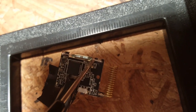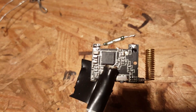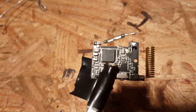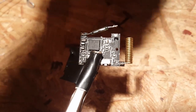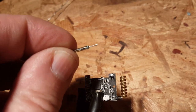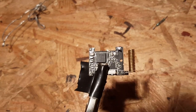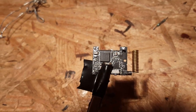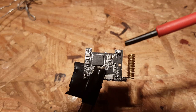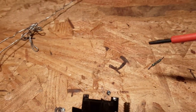Stick a tiny screwdriver in while heating the solder and it pops right out. Hold the other side, heat up the other solder point, and pull the sensor out. The reed switch is out. Your two key points that you'll be soldering wire to are right here and here, where you removed that sensor.